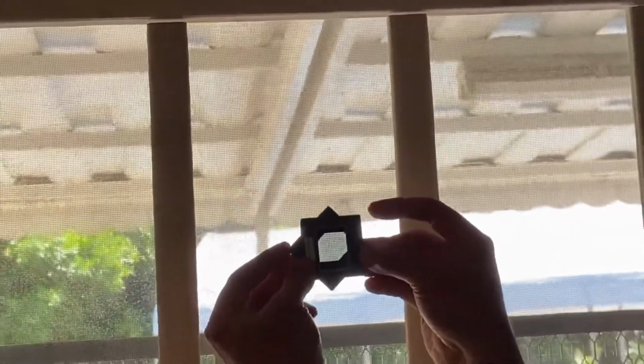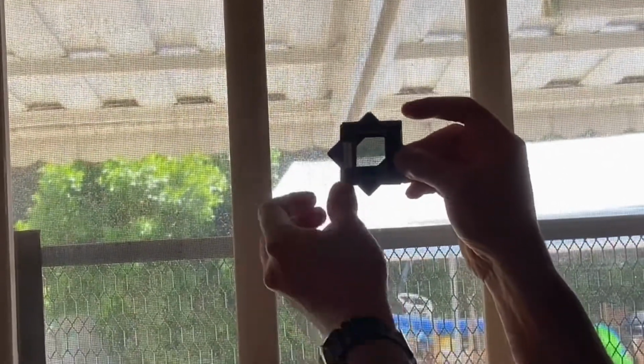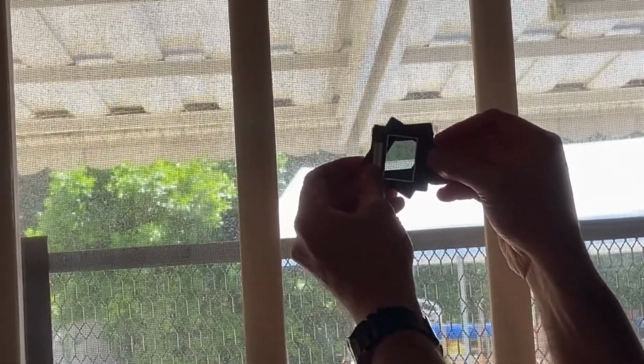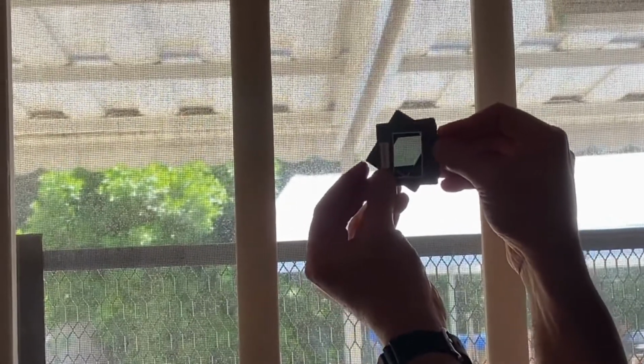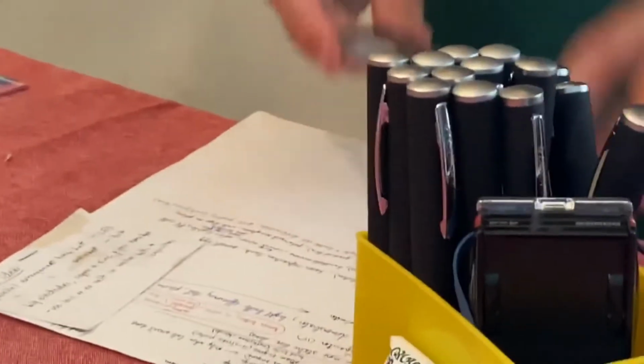The fact that when they're not at 90 degrees to each other, some light passes through, means that all that matters is the consecutive angles. So between these two is 45, and then between the next two is 45. That means there's not 90 directly between any layer, and so I don't get complete blockage. In fact, I can put together even more of these, and if I put together a whole series of them, but just gradually turned or changed the angle, I would not get complete blockage. That's an interesting property of polarizing filters, and it's also exactly how those LCD screens work.